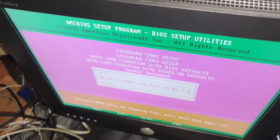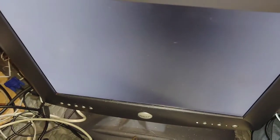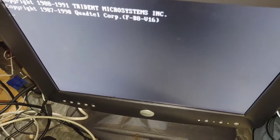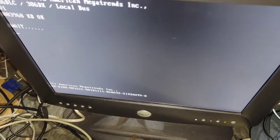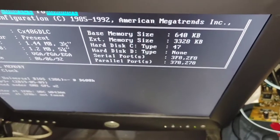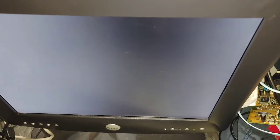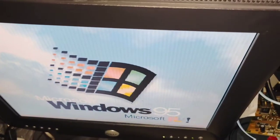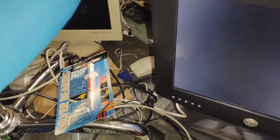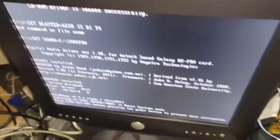And of course I also want to thank Disappearing Ink and Discord for the assistance — couldn't have done it without them. For everyone else dealing with this issue: I thought it was the RTC chip itself that was having problems, but it turned out it was just low voltage on the power supply for the battery.